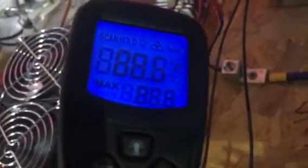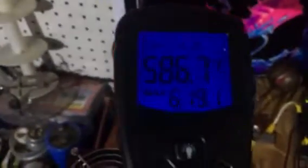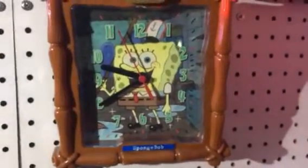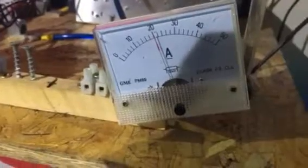This will actually bring it to red — it's about 800 degrees, which ain't too shabby. We're at a minute, just past a minute — minute five. The amp draw actually goes up a little bit with this piece. It's at 16, now it's at 20. So as it gets hotter it seems to be drawing more, probably requiring more heat.